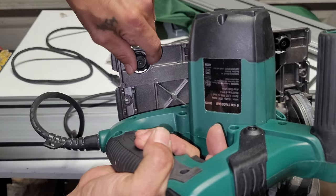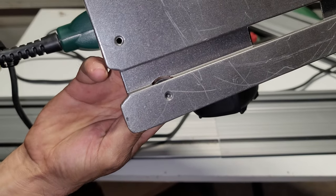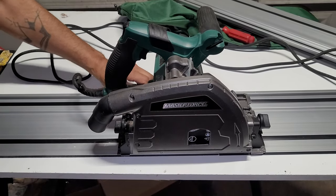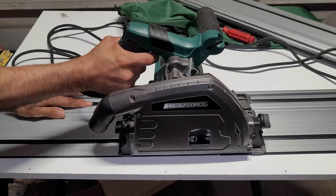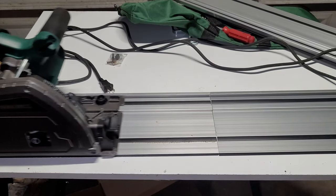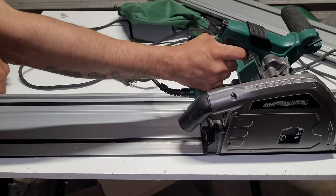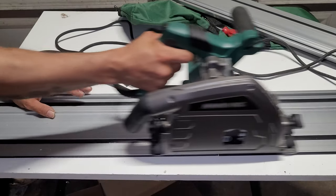Right back here it's got these nuts — you turn them and you can see that turns these cams in. So you set it on there, get it tight that way, and tighten on your cam — this one too. See, the wobbliness is gone — no more left to right and it's tight. Loosen it up — that's perfect, minimal wobble. It slides nicely, though it grabs for some reason right around here.